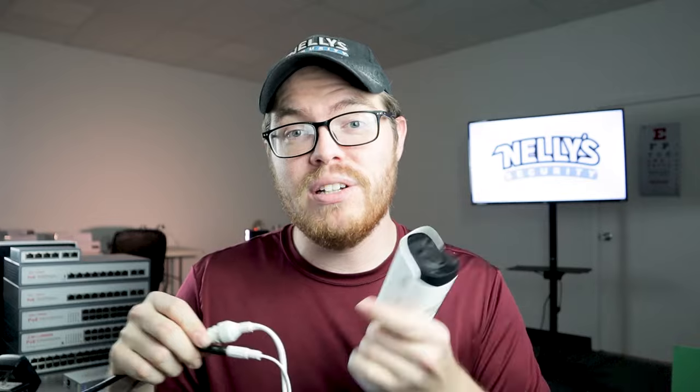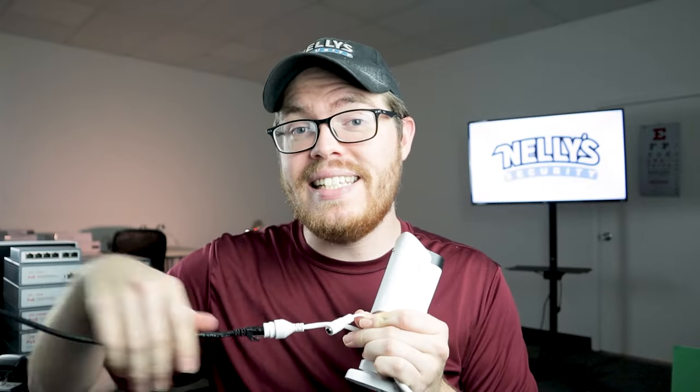We're not in the 20th century anymore — this is 2020. Sure, we might be in the midst of a global pandemic, a crashing economy, an incredibly divisive political climate, but the good news is we have power over ethernet. There is no reason why you should still be running two whole cables to connect one IP security camera. I can actually completely ditch this 12 volt DC connection because this ethernet cable has everything it needs to carry both network connectivity and power to my camera. But for that to happen, I can't connect this cable to just any standard switch or router — it has to be a power over ethernet, or PoE, switch.